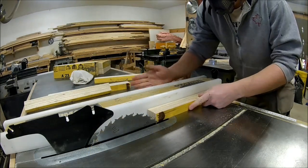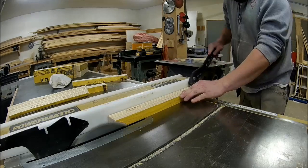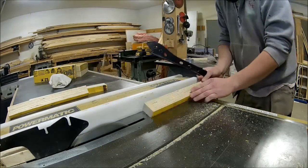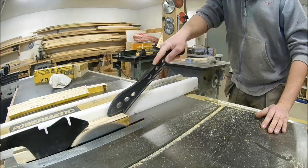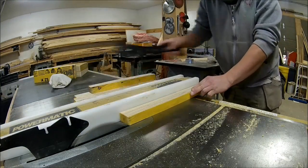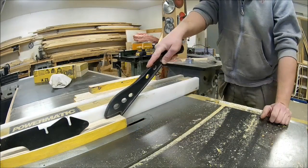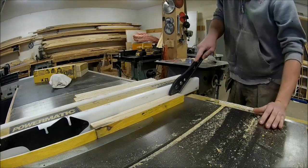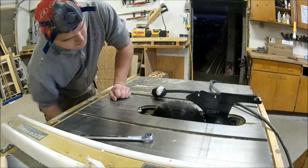The adhesive and outer coating on the material will dull cutting tools. Instead of using the jointer or planer, I dress the surfaces on the table saw. After I'm finished ripping the strips, I swap in a better blade so I can cut the segment to length.